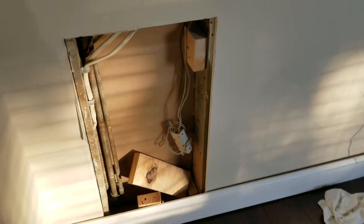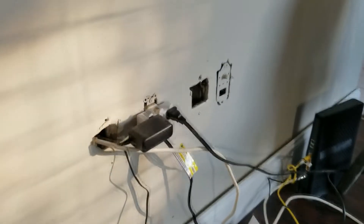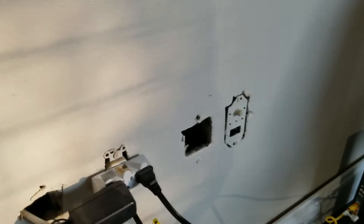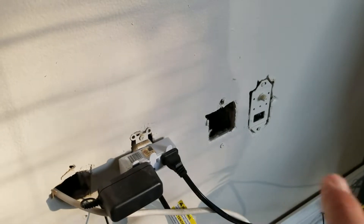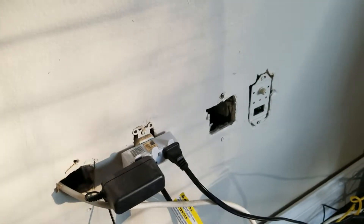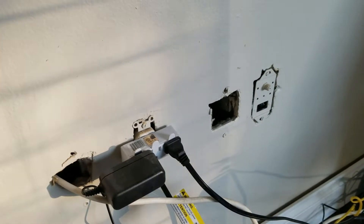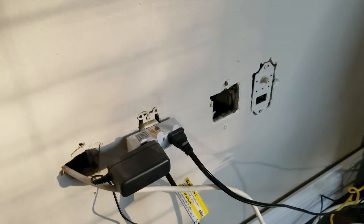So what we want to do is look in detail at this hole here. Normally when we're going to fill in a hole like this we will get drywall, and like on the smaller ones over there, what we typically do with the smaller holes is we'll get a piece of drywall just a little bigger than the hole and trace around the drywall piece and then cut it out of the wall. That way we have an exact fit — no gaps, no going back to try to shave off a sixteenth of an inch to get it to fit.